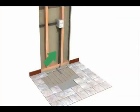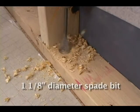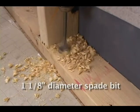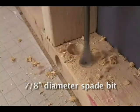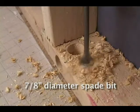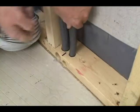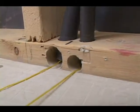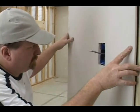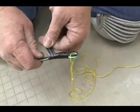Now is a good time to run the cables from the floor to the controller. If the floor plate and joists are exposed, use a 1-1/8-inch diameter bit to drill a hole from the top of the floor plate and then through the side. Then use a 7/8-inch diameter bit to drill holes for the sensor. Run conduit from your control box to the holes. Drop two strings from your controller's electrical box to the floor below. Run the electrical supply and finish your drywall. After your warm wire is installed, join your power leads with the string.